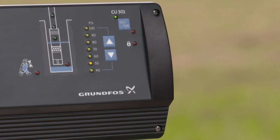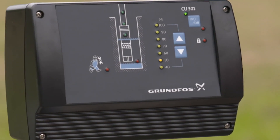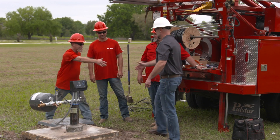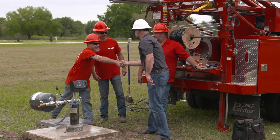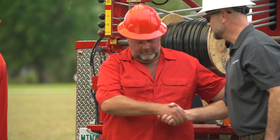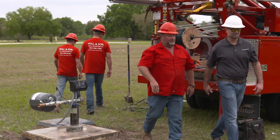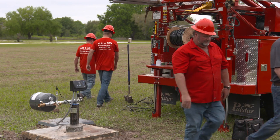Lastly, check the flow of the pump for any signs of trouble, including sediments or sudden flow rate drops — these could be signs of a problem with the well. Once installed, the Grundfos SQE constant pressure system is maintenance-free and reliable, delivering many built-in benefits and protections not available in a standard 4-inch submersible. For more information on the Grundfos SQE constant pressure system, visit grundfos.us.